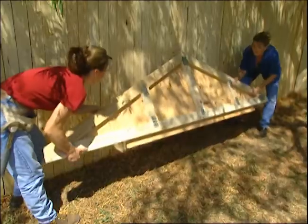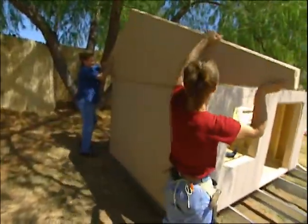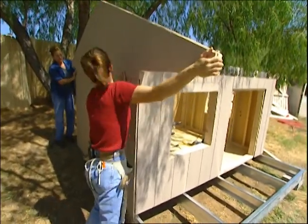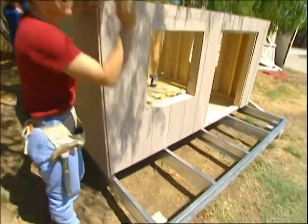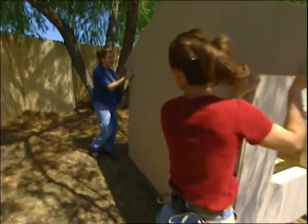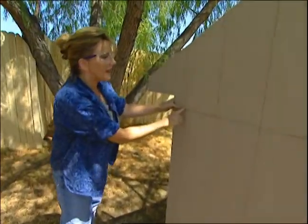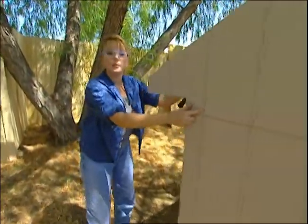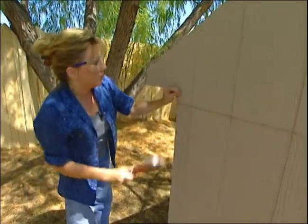We have all of our walls up, so now we're ready to put in the first of two gables. We're going to put one on each side of the playhouse — this is going to be a ranch-styled playhouse with a gabled roof. Because of the gable, it has this extension which will allow us to put in a covered front porch a little bit later. Make sure that the channels in the siding are lined up on your gable and your exterior wall, because that's going to give you the best look. I'm using two-inch galvanized nails to nail this in place into the top board.